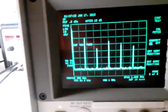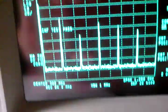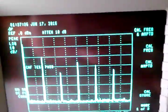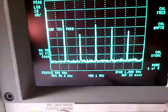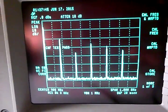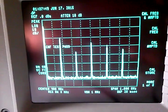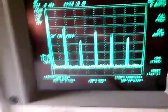Here's the big one — I'm going to run the frequency and amplitude calibration. But before I do that, I'm going to let it warm up a little bit, because it really does have to warm up for about 20 or 30 minutes before I do this calibration test. It would pass it anyway, but I'm just going to let it warm up. Be right back.